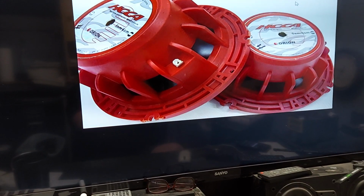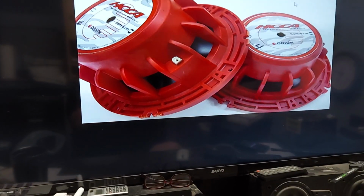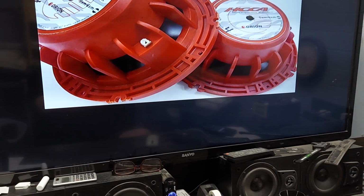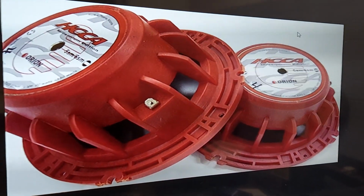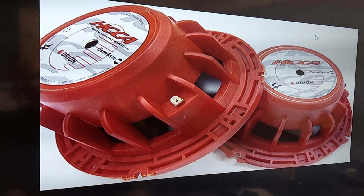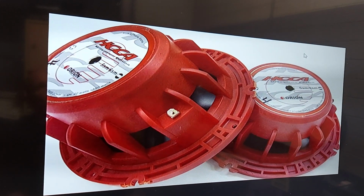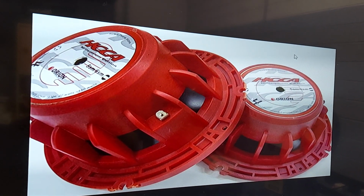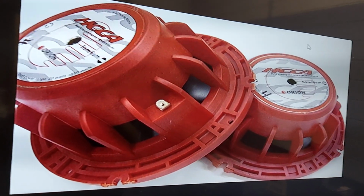I guess it was like a 150R HCCA amp, and see on that 150R, that's a 4-channel, and one half is high voltage and one half is high current. And there seemed to be some marketing differences. If you read Bob Carver's white paper, he talks about how tweeters really prefer high current and woofers really need high voltage. Well, the belief is the opposite. And so I think that's what happened on the 150R, on the execution for that.